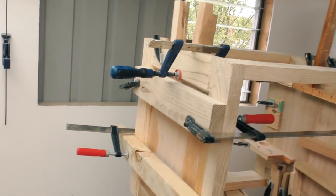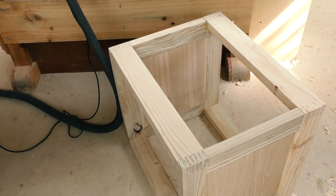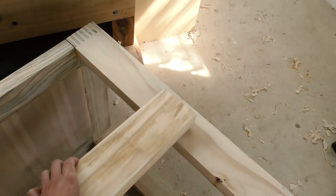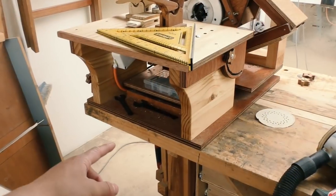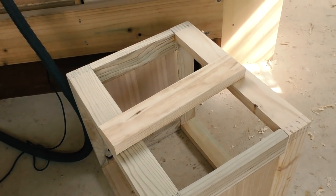I've used up all my big clamps and all my small clamps to do this, and now I just have to wait for the glue to dry. The very next day I gave this quite a bit of sanding to make it look good again. I've also decided to add another cross piece down the middle to support the base of the panel router and also to support the linear bearings which run across the middle of the base. The middle piece should stop it from sagging too much.